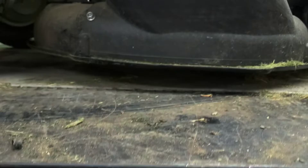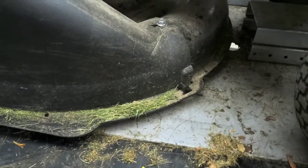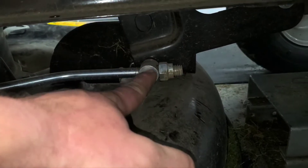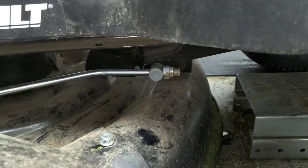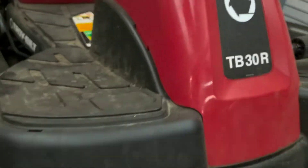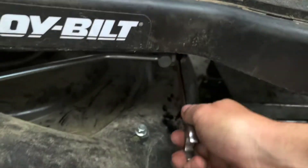The front of the deck is down for sure, but the front of your deck is always supposed to be a little bit lower. We're probably about a half an inch off. This is the deck adjustment for the front of your deck — if you adjust it forward, that's going to bring the front of your deck up; loosen it outwards and that drops the front. It's a three-quarter inch nut, and it doesn't have anything that really tightens it down — it's a locking nut, so it's supposed to stay in place, but over time they will drop.